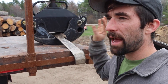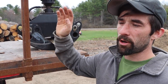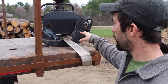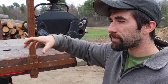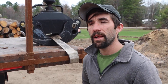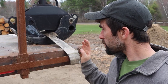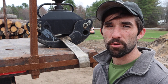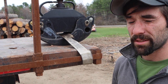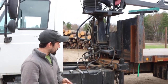Having your grapple close as much as possible is super nice. When your trucks end up being bigger there's a different style — more of a pinch type versus a bypass like this one. This style can be a pain sometimes to get logs out of a pile, especially if you're sorting into different piles, but for grabbing brush and general stuff it's super nice. The one that can close the smallest is often the best option if you're in the same industry we're in.